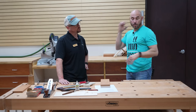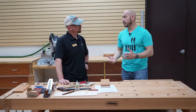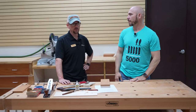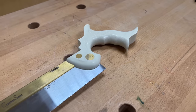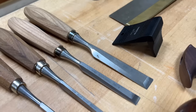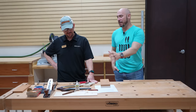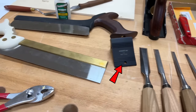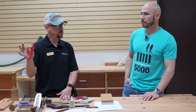If somebody is a beginner woodworker starting out and they wanted to make boxes and drawers, dovetails would be an option at less cost than trying to outfit a full wood shop. The bare minimum tools for hand cut dovetails are a dovetail saw and chisels. A more complete setup would add a dovetail marker, good set of chisels, marking gauge, and marking knife.